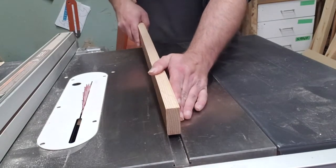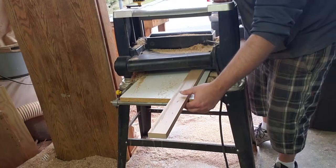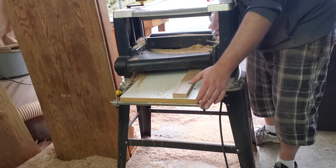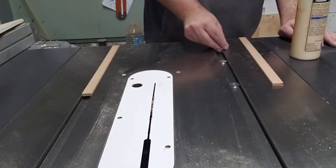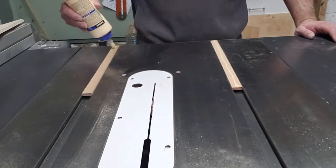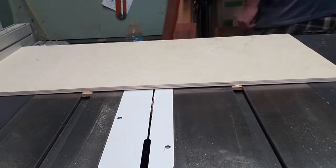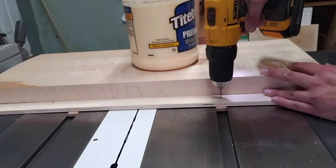I found this old piece of oak coffee table that was just about the right size for the runners, so I planed that down nice and slow until it fit nice and snug in the miter slots. Then I ripped a couple of quarter-inch strips off of it, put some washers in the slots to raise them up above the surface, a little bit of glue so that it didn't squidge out all over the top of my table saw and make rust spots later, and then glued the base down to the runners.